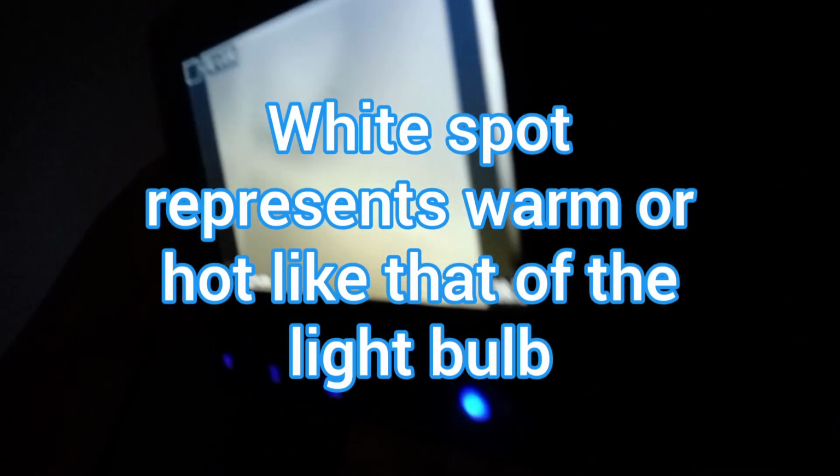So let me turn off the light, because sometimes the light shows up as presence of heat. Now it's clearer, and I'll take a picture of this and share it with you as well. So you can see there is moisture. If I could use my other hand, I could have fine-tuned it well and pointed out exactly which area on that ceiling is the source of the leak, the drip. So the water is now starting to destroy our ceiling. What else? Let's check here.